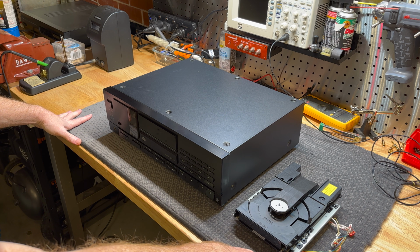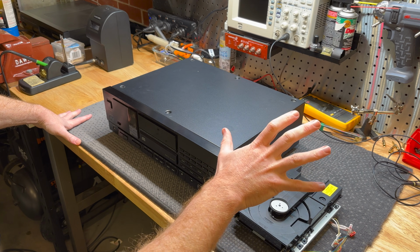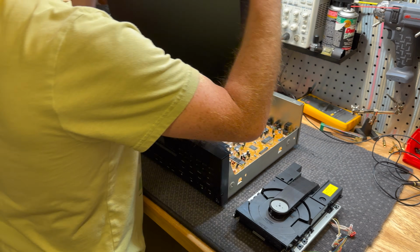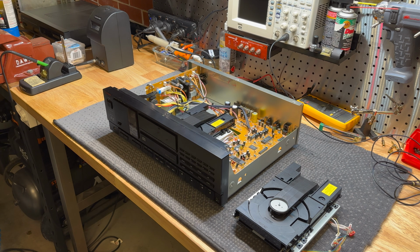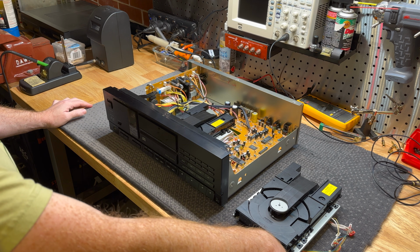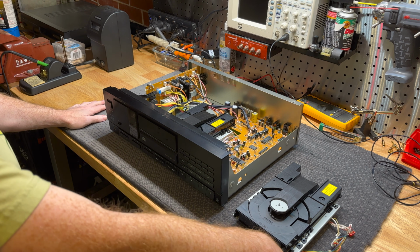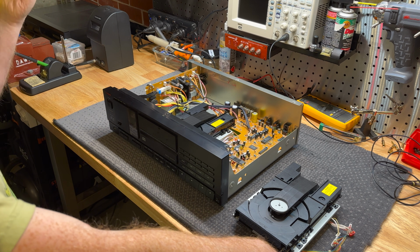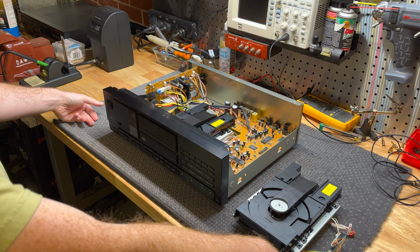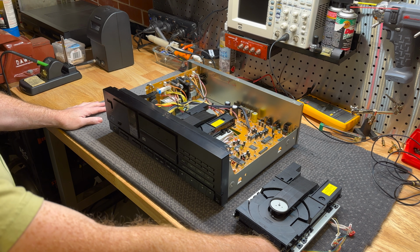So the CD player had the same issue as you would have seen in the DZ111. The belt was screwed. Replaced the belt. Put this thing back together, and I don't know if it was actually working or not because I never got that far. Basically what I did is I plugged in two connectors the wrong way around. They're identical connectors. One's red, one's white, but they physically will fit in each other's sockets, and basically nuked the CD module or the CD transport.